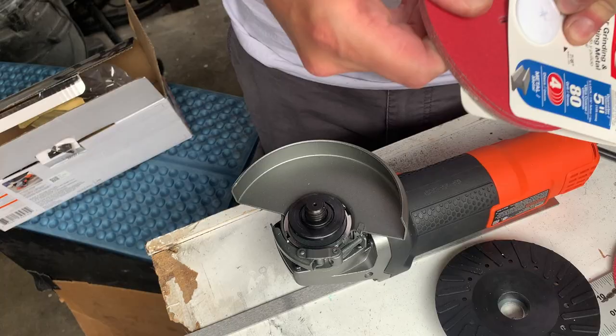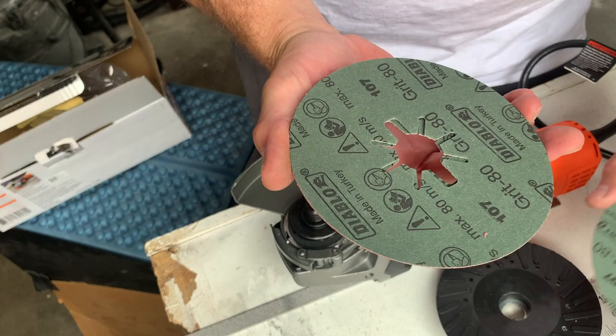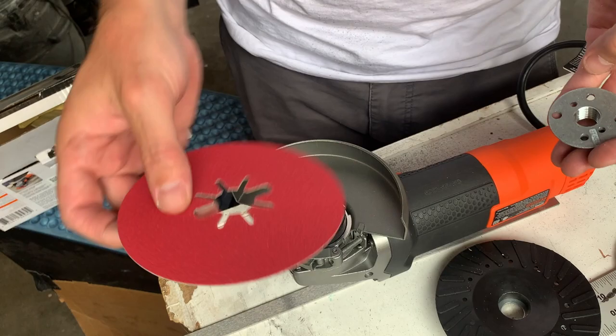We're going to do most of the grinding with a sanding attachment. Hopefully you can find this in one unit — a backing pad and a sanding disc. You can see the one you generally find in stores; I couldn't find it on Amazon. I would highly recommend it. Get some backup sanding discs at really low grits — 40 or 50 — because these are going to really grind that steel away.